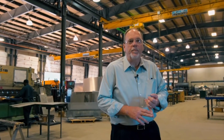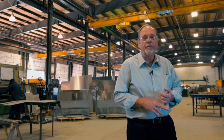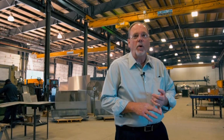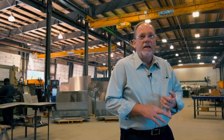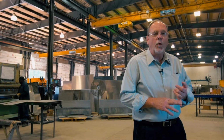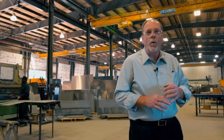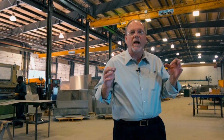This is where your material is requisitioned, be it stainless steel, steel, or aluminum. The fabrication department will take your prints, shear the material to size, bend it if necessary, roll it into the shape of a tank. And the basic shape of a tank is 4 parts. You have a floor, 2 sides, and a top. We can go down and look at that particular equipment.